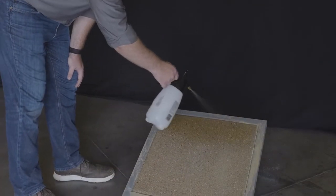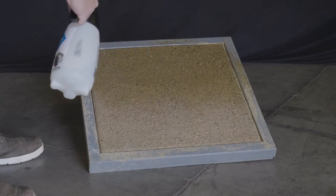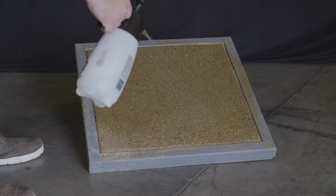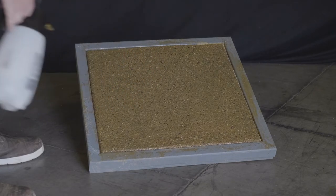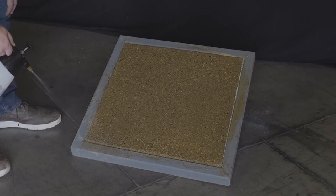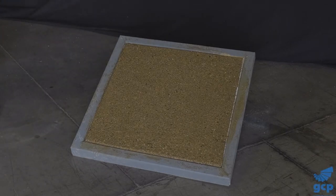Uniformly apply by using a low-pressure spray, roller, or brush. Do not allow TopCast CS400 to puddle. Multiple thin coats are preferable over heavy coats. After the first coat is dried, application of a second coat will provide a longer-lasting gloss film with improved water retention properties. Re-application can take place as soon as the previous coat is dried. This will add a semi-gloss finish to your project.